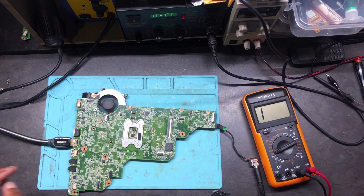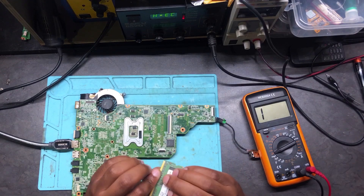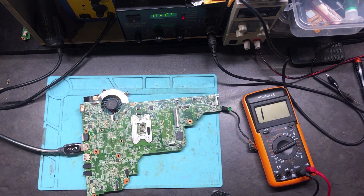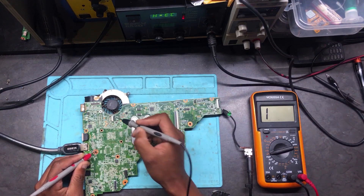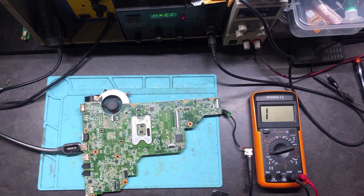You can see the LED light. I forgot one thing — I forgot to connect the RAM. Let's connect the RAM chip and see if we get a display on the HDMI. Let's turn on the machine again: touch the pin with one probe to ground and the machine turns on automatically. The fan is spinning, but as you can see there is no display — it's just blank.